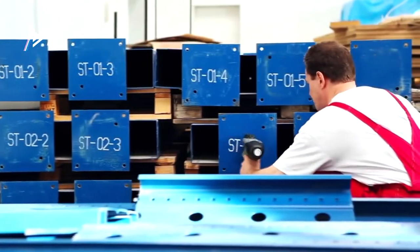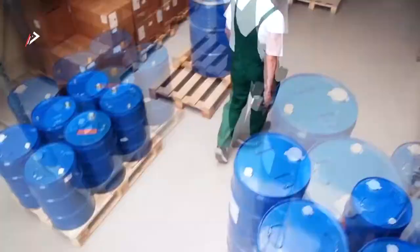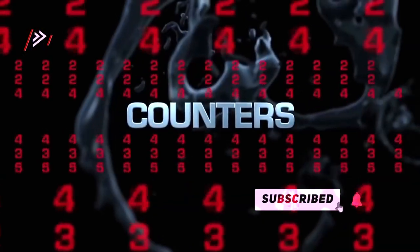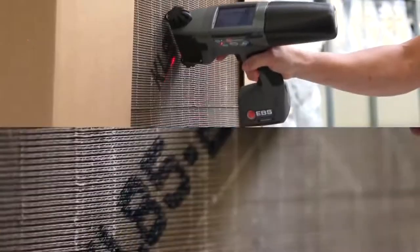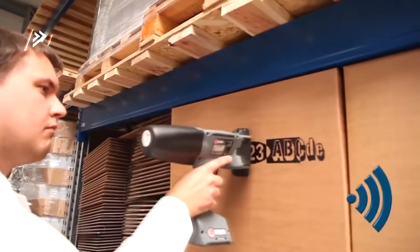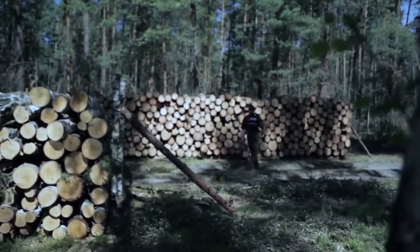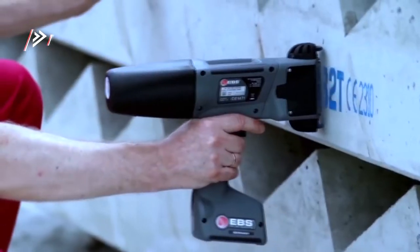A comprehensive range of accessories is available, including printing guides to allow printing on awkward shaped products, narrow products, and soft materials. The handjet has virtually unlimited print message storage with messages stored in folders for quick recall. The Handjet EBS260 provides reimagined features and functionality for even more innovative, portable coding. The EBS260 print height has been doubled to 32 dots with print heights up to 2.2 inches, providing 1 to 4 separate lines of code. We have increased the capacity of the ink cartridge to up to 200,000 characters in a 7x5 matrix. Single or multi-line messages from 0.276 inch to 2.2 inch high can be printed on both porous and non-porous substrates.